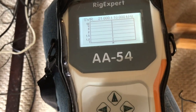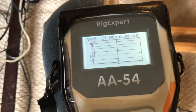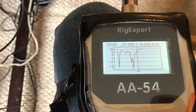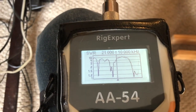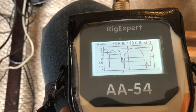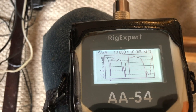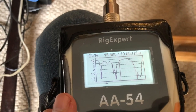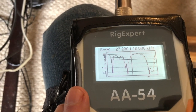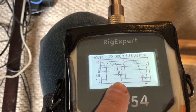I've already selected a plus or minus 10 megahertz span. Now when we check the SWR — it comes down, there's a spot. You'll see that it is resonant below 15 meters. When it comes up into the 10 meter range, it's fine. Moving the cursor down, that's about 18 megahertz, and going further down we go right through 20 — we're resonant at about 13 megahertz. Going all the way up the other way, this is the 10 meter range — at 28 megahertz it's resonant up there. So the issue is 15 and 20.